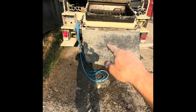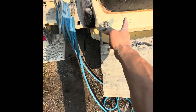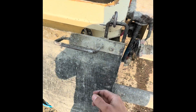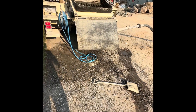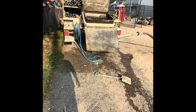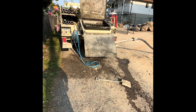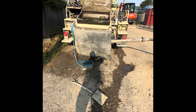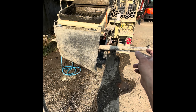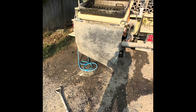Rolka Ready Mix here - they make us run this safety mat too. It's just a piece of heavy conveyor belt trimmed to size, couple loops, piece of metal, some brackets welded on. They actually won't back up to the pump if you don't have that. And they can also refuse if you don't have the chains - they're not as sticky about the chains, but the mat there, if they don't see that, they won't get near the pump. It's not a bad idea - it happened because a few guys were letting their elbows run way thinner than they should have when there were some incidents. A little extra safety measure.